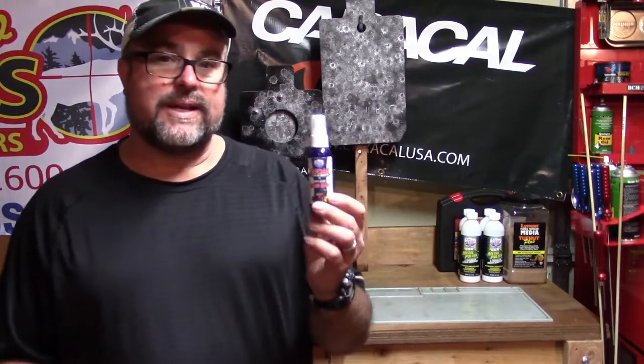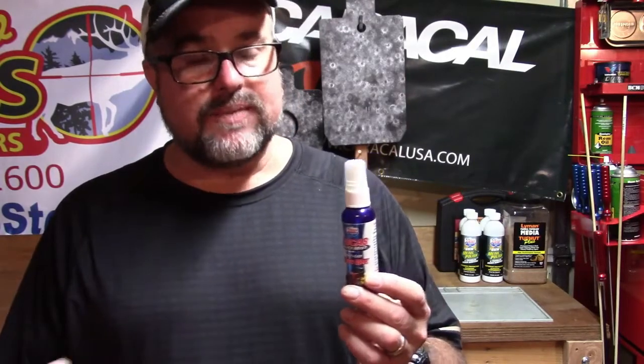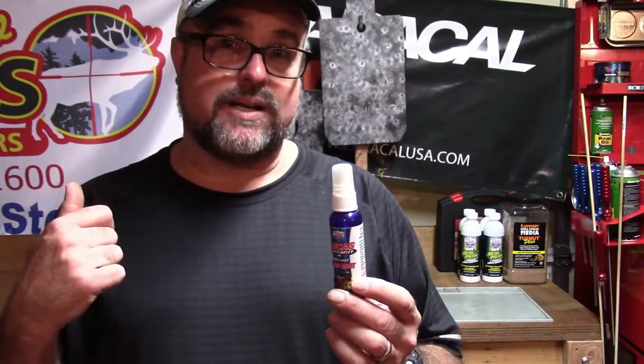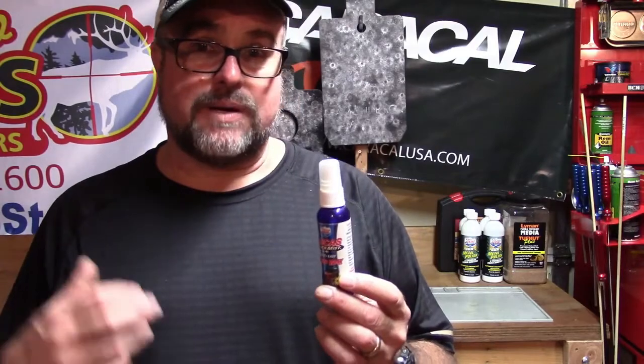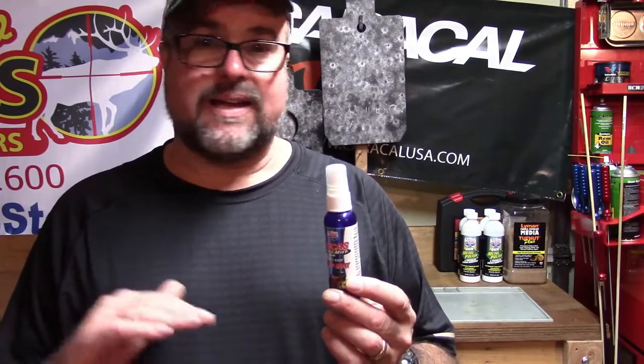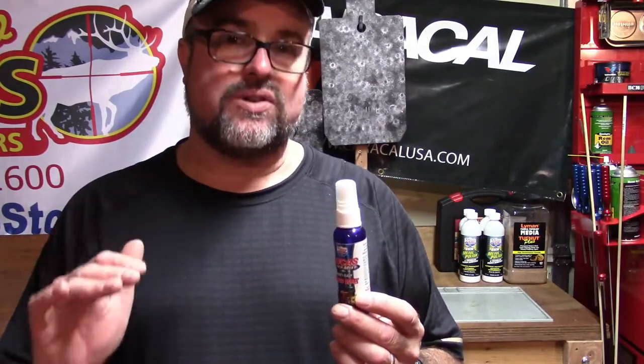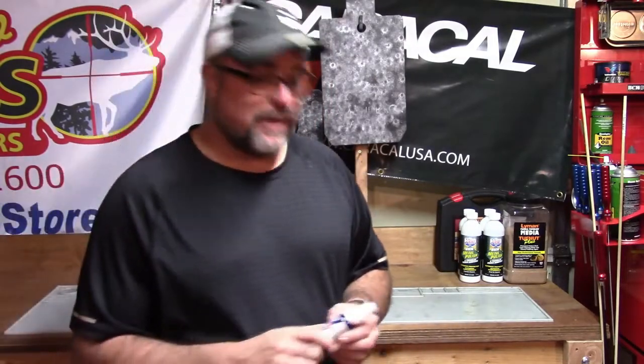I'll tell you the other thing I do with this. There's another product I'll show you by Lucas pretty quick. It's a solvent, it's their bore solvent. I clean my dies with that. And after I clean it, I put some of this on some of my bore patches, my big bore patches. I run that through the resize die, and it puts a slickness on that die, and it sizes like no other die. It's good stuff. So this is also in that competitor pack.